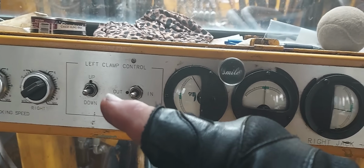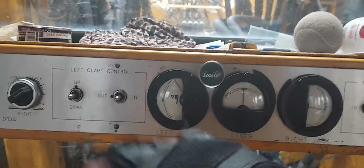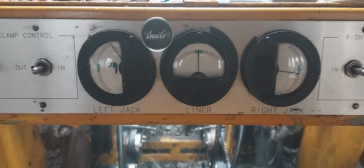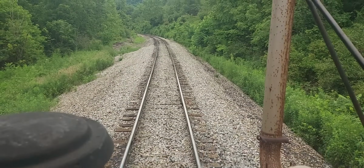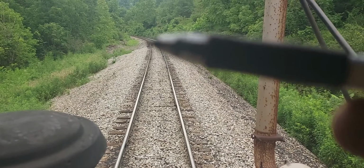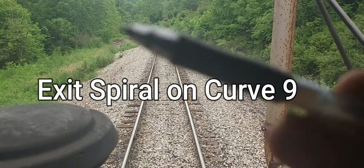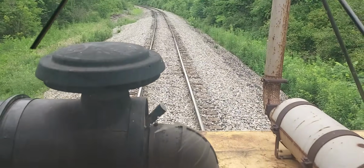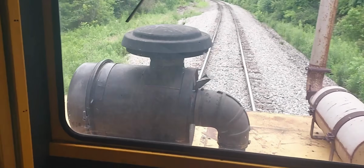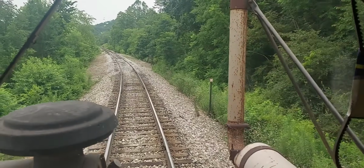Okay, and I got some super elevation in it. I've got about 1/2 inch of super elevation right here at this entry spiral on curve 9. So wonderful, wonderful, wonderful. That spot is fixed. Nice. Okay, right here, this high rail was down like that. I got it picked up, so that's off the geometry lift. Plus a couple of joints on this side were a little bit down. All right, wonderful. And this is the east end entry spiral.